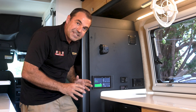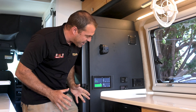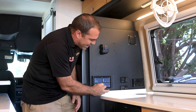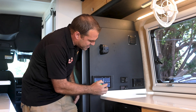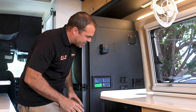This AC switch controls my 240 power points. What I'm going to do with the 240 power points is when I'm done using them — finished cooking, finished with the microwave or air con — I will turn that off. It saves power because the inverter draws 22 watts just on standby. So make sure you turn the inverter or the AC switch off when you're finished.